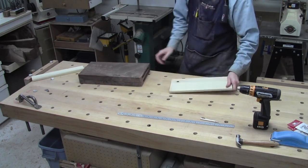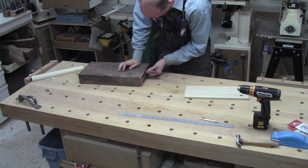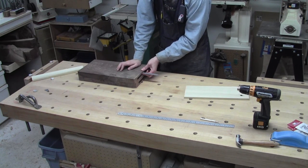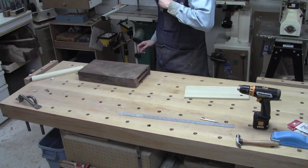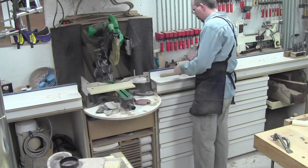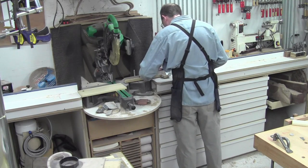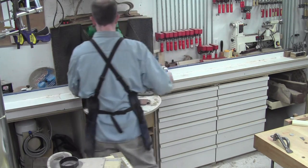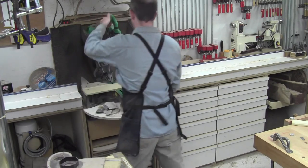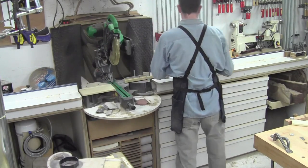That's good. Okay. So now I'm going to take my depth of, it looks like it's a heavy 1/64 shy of 1 7/8. So if I cut this at 3 3/4, it's going to be a bit long. So we'll go a little over 3 1/2. Over the miter saw, just a real quick cut here of 3 1/2 heavy. We'll go 3 5/8. It should still leave us room. So cut a square end. Cut that off. Pop it free. This will be our tenon stock.